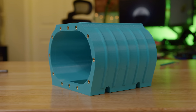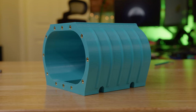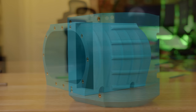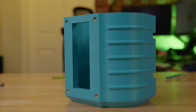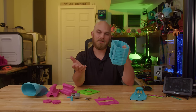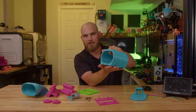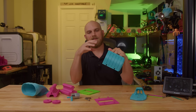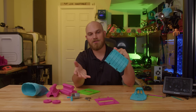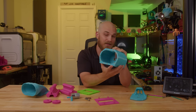I started with the housing. I knew I wanted the supercharger to cool a 120 millimeter radiator, so that drove the whole design. I made the bottom 120 millimeters to cover the radiator. A radiator on the bottom felt perfect because in real life you normally have a heat exchanger or intercooler underneath that takes heat out of the compressed air before it enters the engine. In our case, the supercharger air will hopefully cool our radiator while giving that aesthetic we're going for.